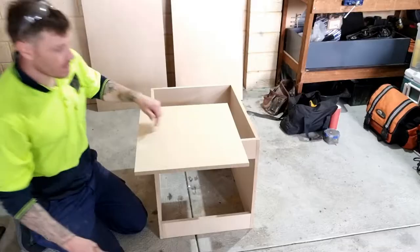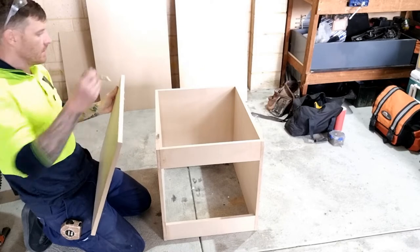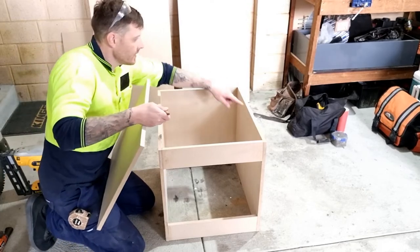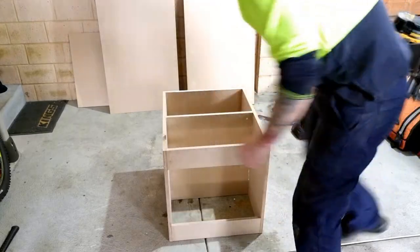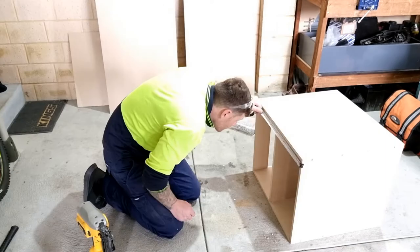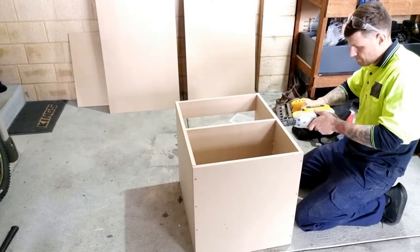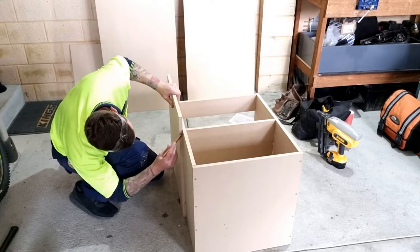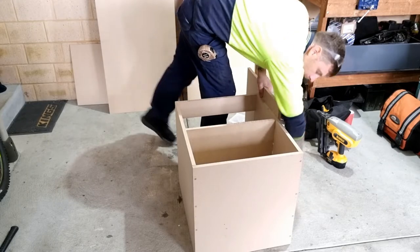That part is all screwed up. I'm going to drop in the centre divider now, like so. All you do for that is just measure this gap, check that that's correct, and I've just gone centre of the drawers. Now just mark the top so you don't go missing — a little pencil line, a bit of a straight edge, nail hole to nail, bit of a line.